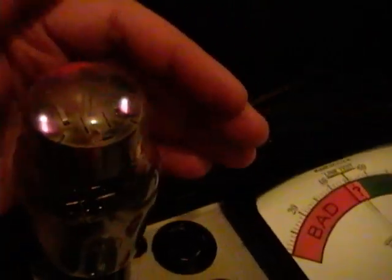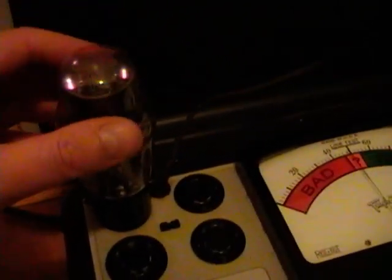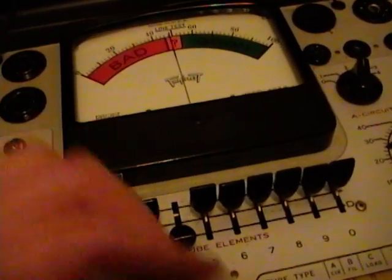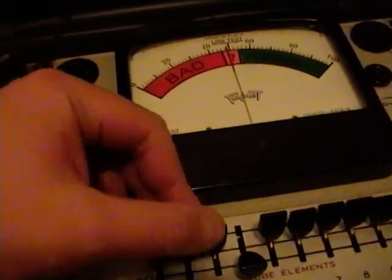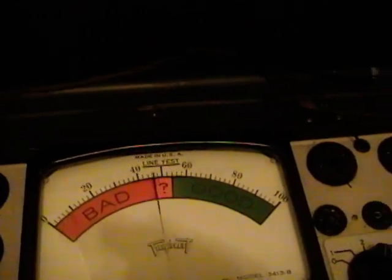Okay, I think that's been plenty long enough. I don't see any mercury condensed at all anymore — this tube runs really hot, about 5 volts at 3 amps, around 15 watts, similar to a 5U4. Here we go testing one side of the full wave rectifier — you can see that beautiful blue glow, which is what a mercury rectifier looks like in operation. Testing the other side now... both sides are testing good.